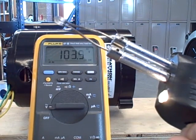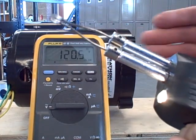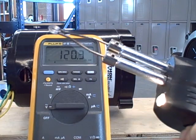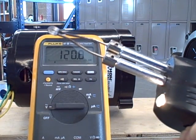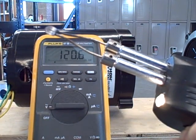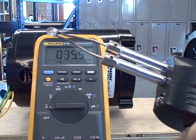Anyway, I just want to demonstrate it is actually possible to get real power out of this thing — powering a significant load with this very simple setup of 320 microfarad capacitors in delta formation hooked up to the stator windings of this motor. So that's a self-excited induction generator. Thank you.